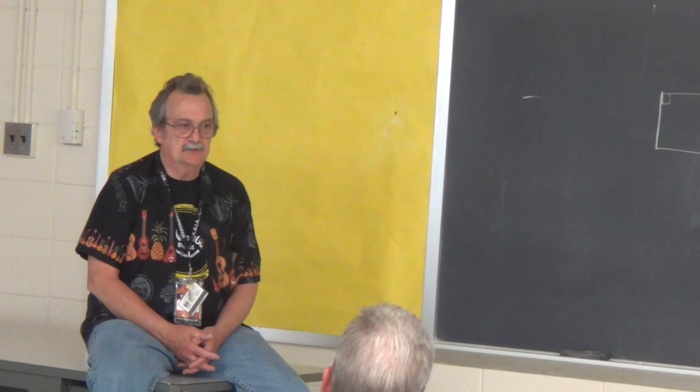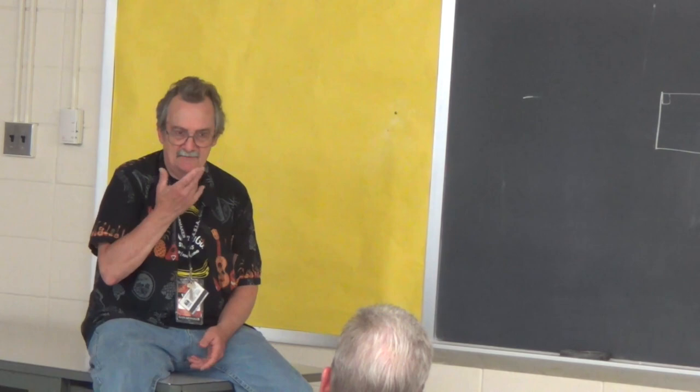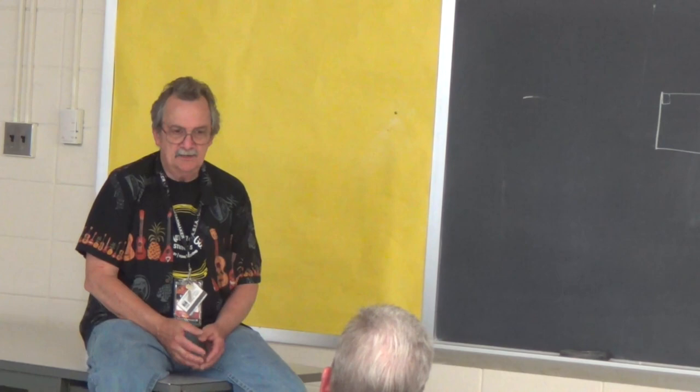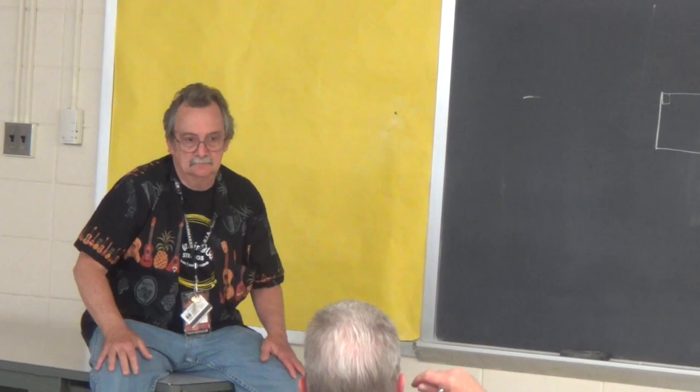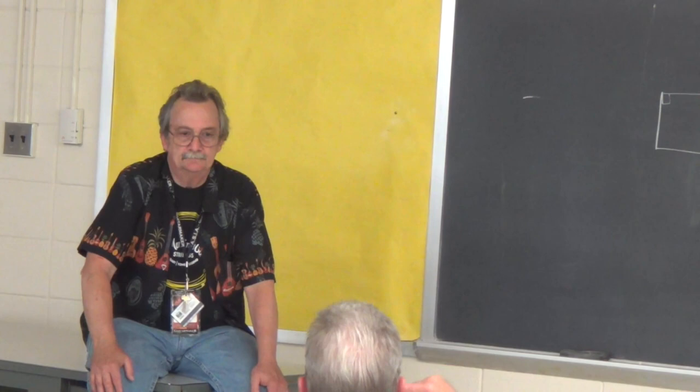Usually what I'll do is wet sand that, because the acetate, the more you work it up, you'll smell the camphor coming out of it, then it's soft. So generally wet sand in 320, you can get it down pretty quickly, and then you buff and polish. You want to buff and polish it on your guitar, because if you flex it, sometimes it's so hot. I've seen a lot of the work that Keeper did for me, but I never really sat and watched them do the pick guards.